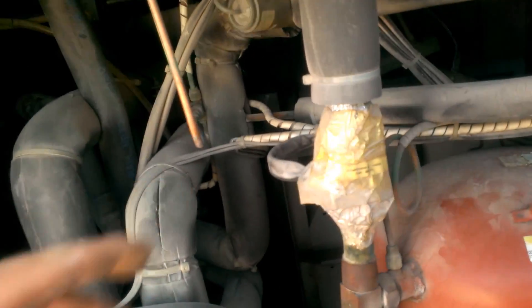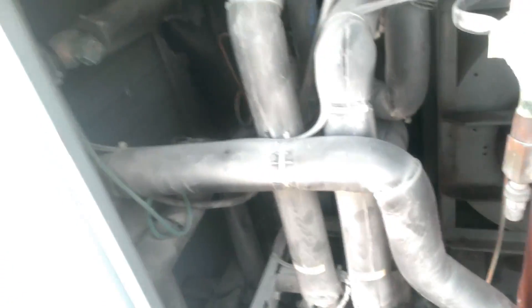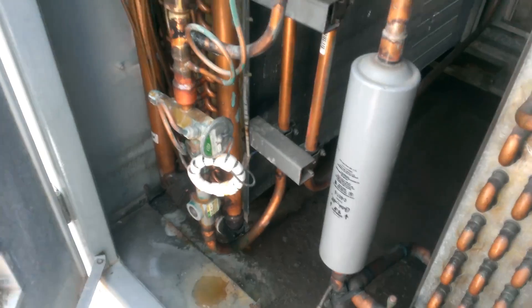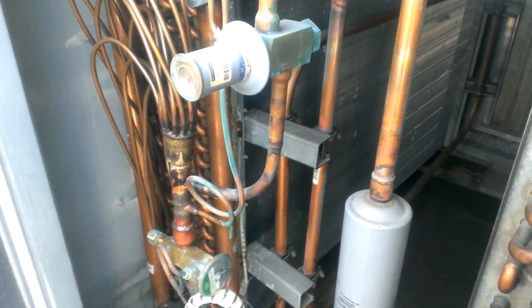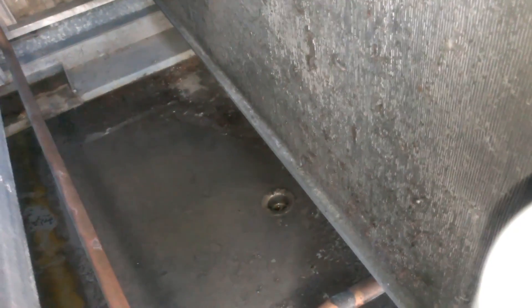There's a lot of changeover valves — one here, one over there. See, it redirects to where the hot gas goes. There's the evaporating coil right there, so it's always removing humidity any time the compressor is running. It goes down that big drain — just like a sink drain fitting, like a basket in the bottom of a regular sink.